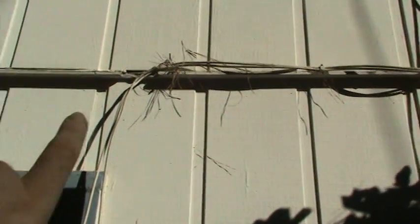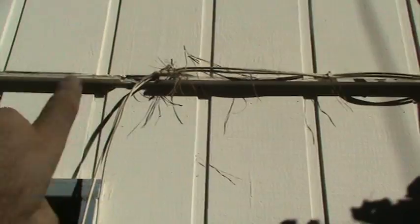Underneath this cable, someone missed the drip guard and drip cap right here and didn't protect that bottom edge of the siding, so it's starting to rot right there at the bottom where there's been a lot of splash.